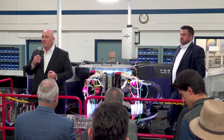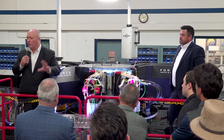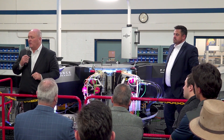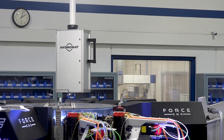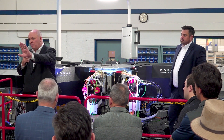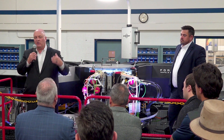Today I'm presenting a rock solid electromechanical ball screw unit and machine. The Hydromat machine is a 40 millimeter spindle machine, HSK 40. The Eclipse is a bigger machine — a 50 spindle with HSK 63. This D-Force machine is a 50 spindle, HSK 50. It fits right between the Hydromat platform and our Eclipse platform, filling the gap that existed between them.